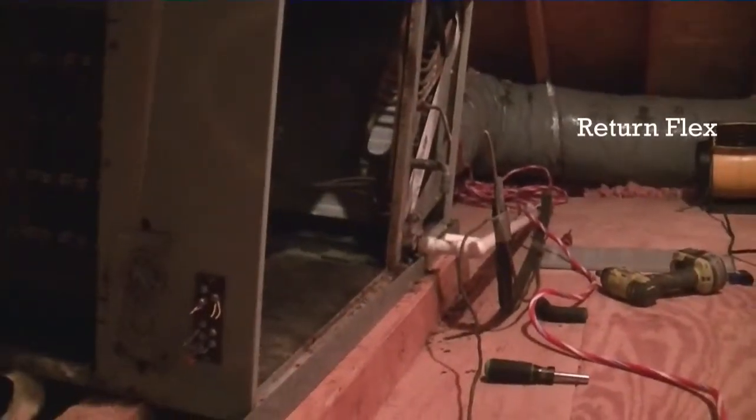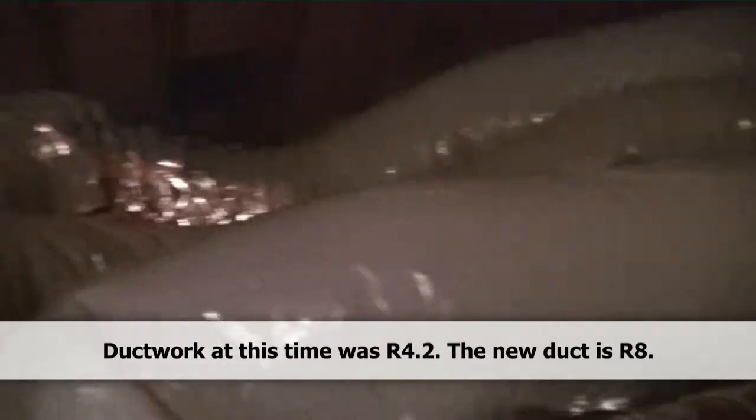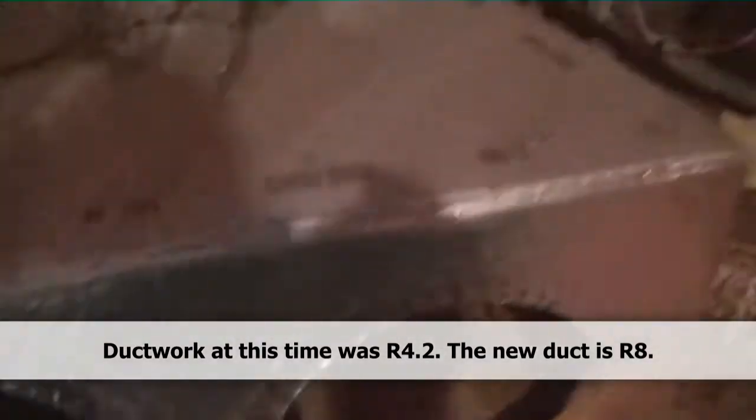Things nowadays are a lot more efficient and tighter — they tape all the seams and even mastic them. I have our air handler disconnected for the most part except for the return in the back, angled down so the water drains out. There's a little bit of standing water in the pan; I've tried to dry it out as much as possible. I went up in the attic and got all the flex and ductwork out, including our duct board triangular box — a pretty common ductwork fitting with a main duct coming into the box and branch ducts trimming down to the very end. So we have duct board, flex, and metal trunk in this system, and when I come back it's going to be all metal trunk with just flexible branch ducts.